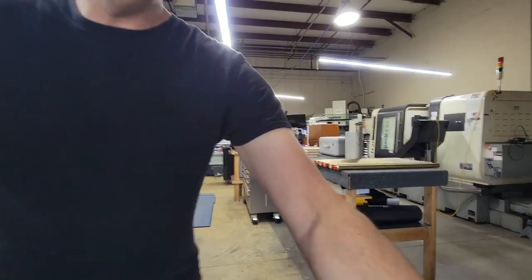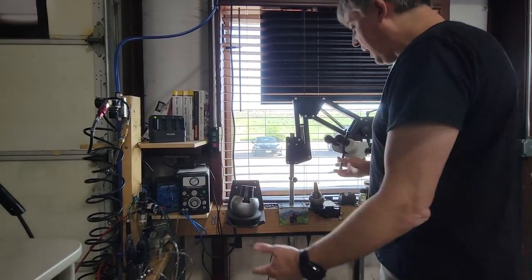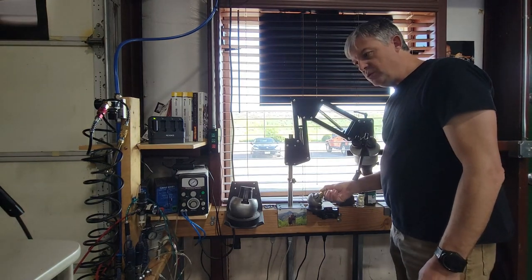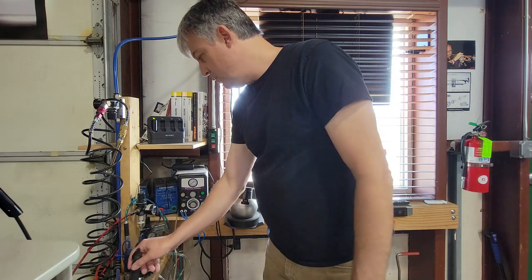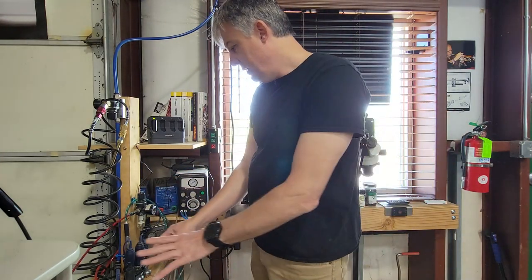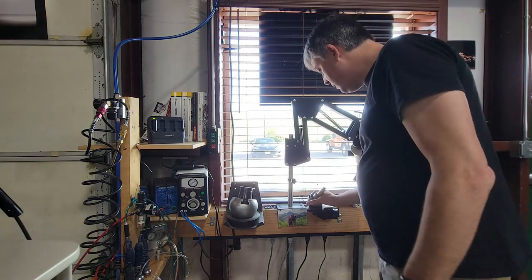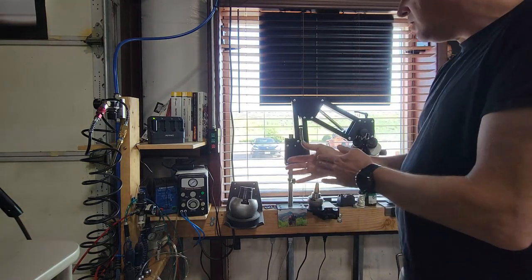This area is where we can do custom engraving. This is a microscope I can use to sit down and work at these stations and do hand carving, either with high-speed rotary tools or with engraving tools — actual gravers. You can see those tools over here: there's a rotary tool, a bunch of rotary tools, this one is 400,000 RPM. We also have graver tools. I basically create different profiles and sharpen them, then we can do the hand engraving. Sometimes I'll do full mouthpieces. When you see the hand carved and hand engraved stuff, it's done right here.